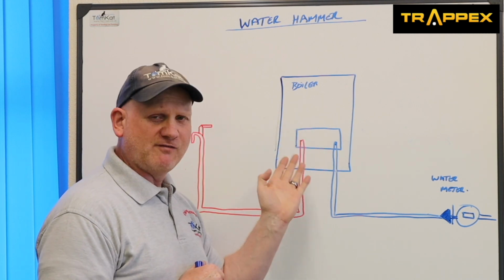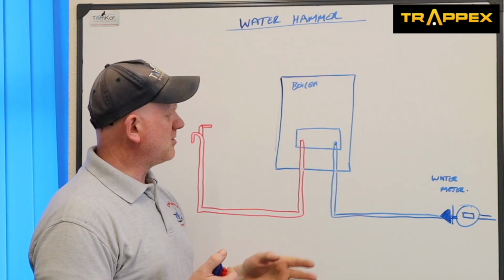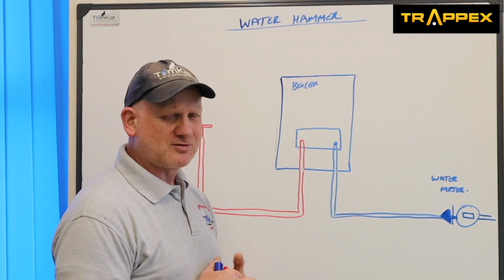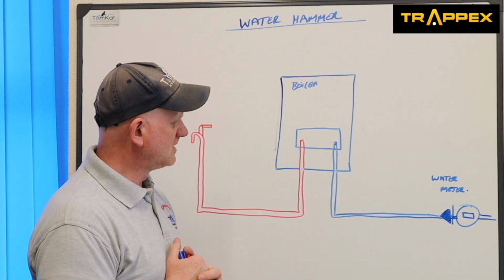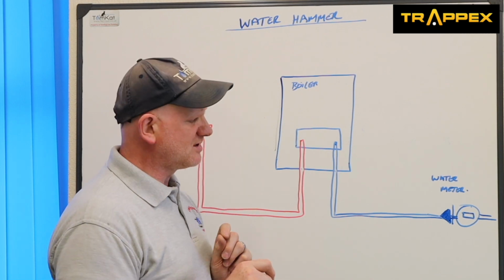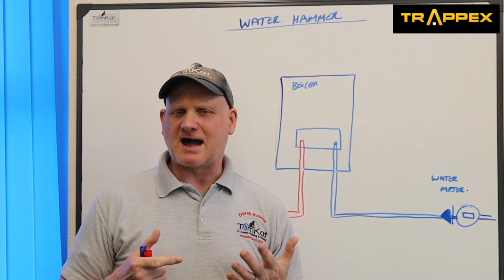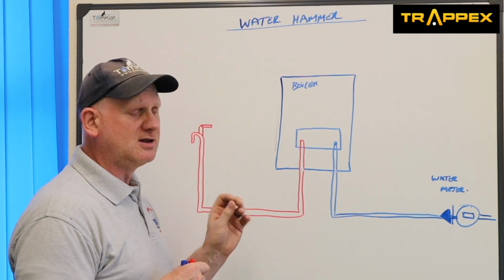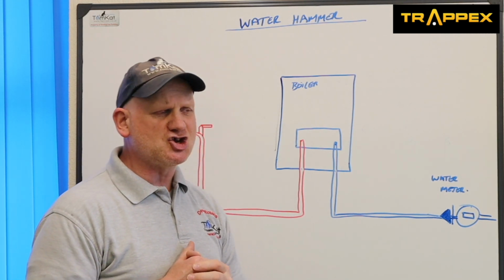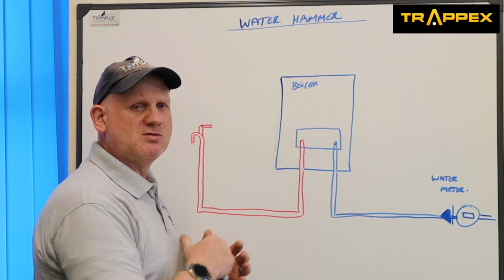Because we can create a lot of heat in that plate to plate with things like preheat systems. If we preheat the plate so we don't get this big lag of cold water coming through, that can create its own pressures and problems. The manufacturers say, and technically you only need to fit these if it's a plastic hydroblock, but if you do have things like water hammer, because this can create water hammer as well, the flow of the water going backwards and forwards can create a vibration. So if your pipes are not clipped properly, you'll get a vibration coming through there.